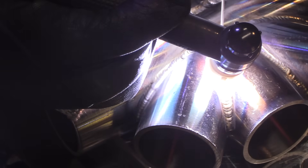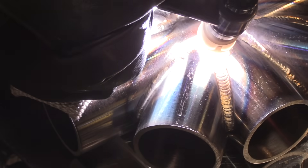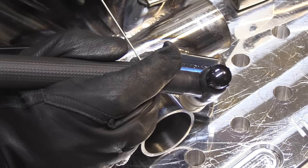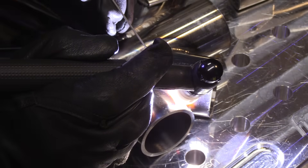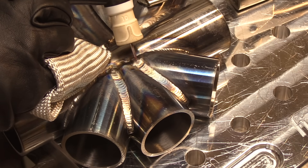I set the machine an additional 20 amps up to 140 amps max, and I'm just kind of stomping the pedal full and then backing off to probably around 110 amps or so — I wasn't watching the machine so I'm not really sure. Backing off just to give myself a little time to turn my wrist and to feed rod. I really admire the work that Joel does, that Frank Fleurquin does, Eli Lattin — they all seem to pump the pedal like this. There's a lot of benefit to it for chromoly cluster joints because when you manually pump the pedal you can adjust on the fly — that pulse doesn't come when you're not ready for it.